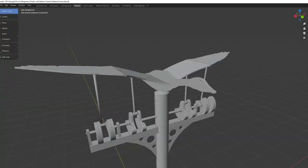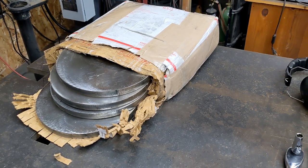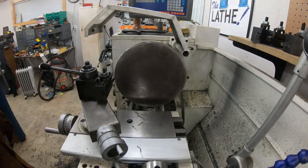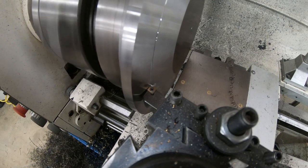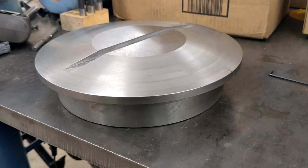Working on the post forced me to finally figure out how exactly the bird body would be mounted on top. It needed to be removable for transportation and, knock on composites, possible maintenance access. I wanted a cap that could bolt on, overhanging the sides of the post a little bit to reduce water ingress, hell for stout in case we needed to hoist the whole thing by the bird body during installation, and with a nicely tapered top to shed water better. Monolithic chunks of metal in that size are quite expensive, so I ended up buying three-quarter-inch offcuts from eBay, welding them together, and then spending an absolutely ridiculous amount of time turning them down on the lathe. This is the danger of larger diameters — the volume of material to be removed goes seriously non-linear. I had a monstrous pile of chips menacing me for weeks. The final result was worth it though, even if it did end up looking a bit like the world's largest screw head. The slot was where the bird body would later be welded on.